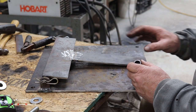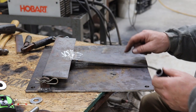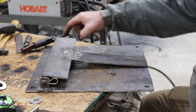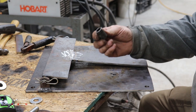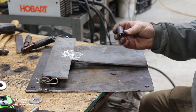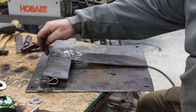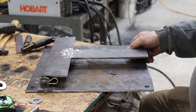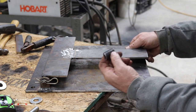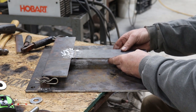All right, I put this back on, flipped the hinge around to the back side, because we got to work on this side. And I don't know if you remember, when we cut that back hinge piece, that piece of black iron pipe, it's exactly what I need for this side here. I need 1 3/16. What I did is I put this up as level as I could and measured down back there, and it was 1 3/16, and this little piece is 1 3/16. So this will make for a nice spacer